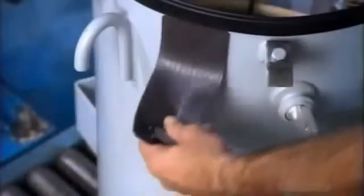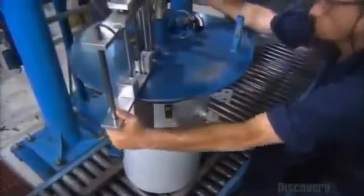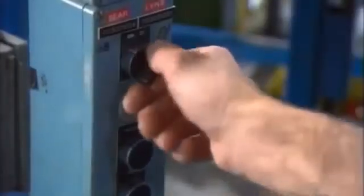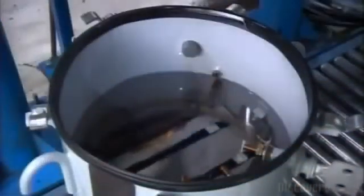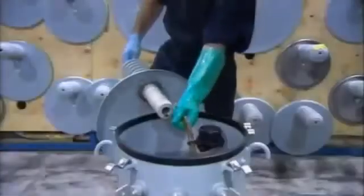They adhere an oil filling guide to the side of the tank, then position an automated filling machine. A machine fills the tank with mineral oil, drawing a vacuum to make sure the oil disperses throughout the coil and cores. The oil is used for its thermal and insulating properties. An internal fault detector will alert maintenance crews if there's a short circuit.